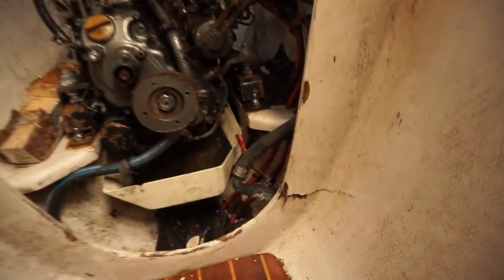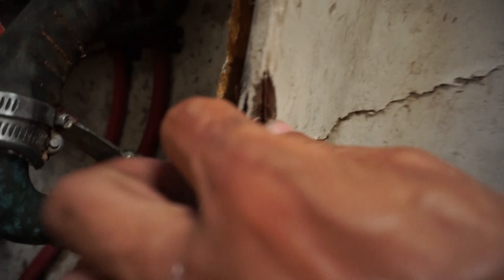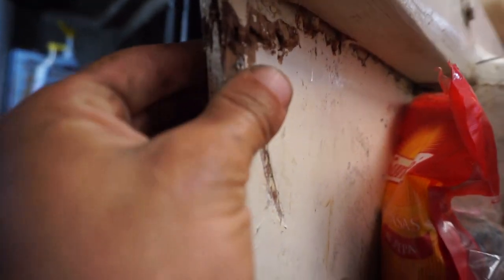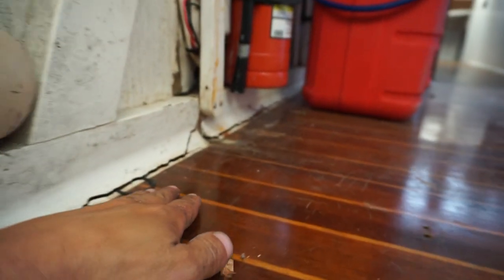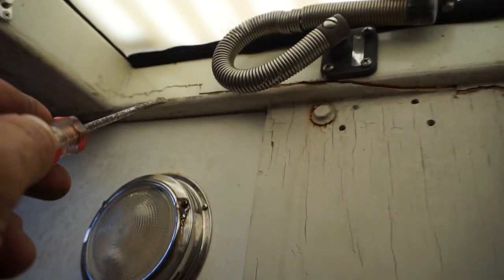Coming out of the engine room now, I'm going to show you one more place that it's broken — it's here. All the fiberglass on the inside is delaminated off of it. It really looks like it had gotten a little bit of moisture inside the laminate, inside the plywood layers — it looks just a little black, a little dark. And that cracked here and went all the way, just delaminated the fiberglass on the hole there. It's also broken here — you can see some of this is looking a little wet, just moisture getting in there. This beam is all broken, and this is delaminated from the deck all the way back to just behind that red tub. Pretty much the same place on the other side — took out this, broke this one, so that separated the deck up here, all the way up to there, and broke this beam too.